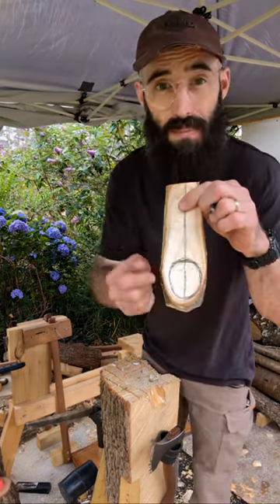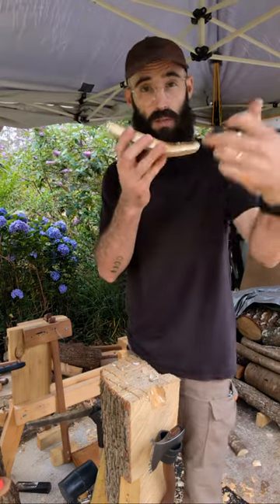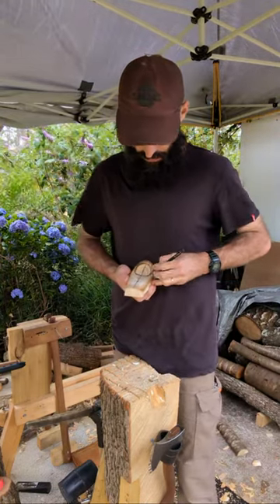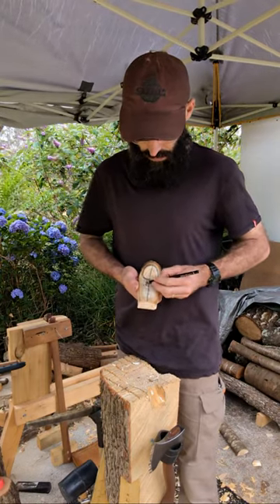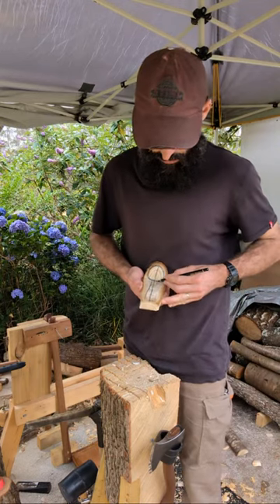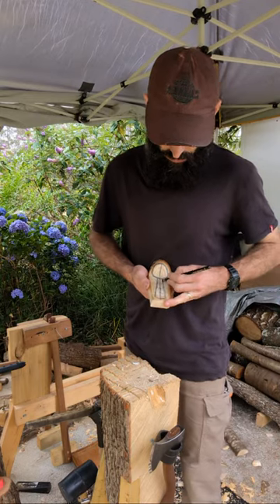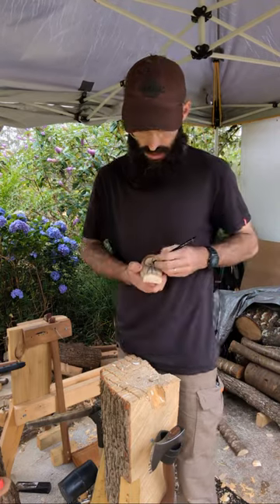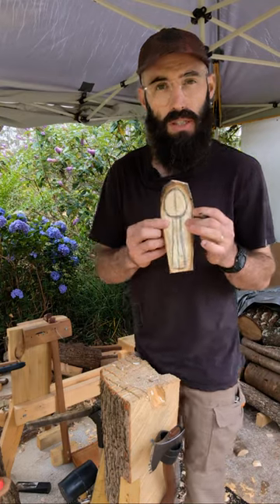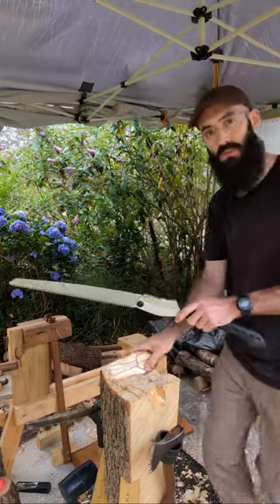What I'll do in this instance is match the grain when I'm working tangentially - that means coming down from the bark as opposed to carving in along the bark or along the radial grain. Then I'll do a very simple little handle shape, just a rough mock-up so this can all be changed as I go. While I usually do this with the axe, I might do it with the saw because this is really dry - I want to hit it nice and clean. The drier the wood gets, the more likely it is to pop away. Just cutting my stop cuts.